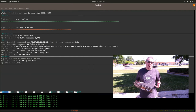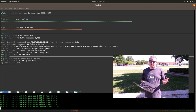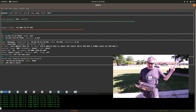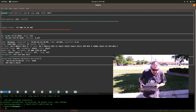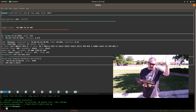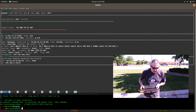We are here across the street and the link quality is roughly 61 percent as measured by Wavemon. I'm going to do a quick ping test because low ping is important — a lot of people use Wi-Fi for phone calls and a high ping time is where you'll start having problems. Ping-wise: no packet loss, 16 packets sent and received, round-trip average looks like nine milliseconds. Now we'll go ahead and do a speed test as well.